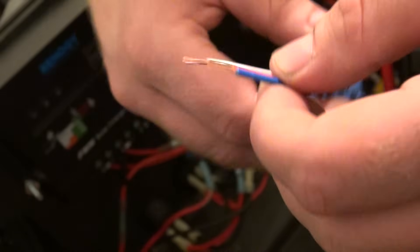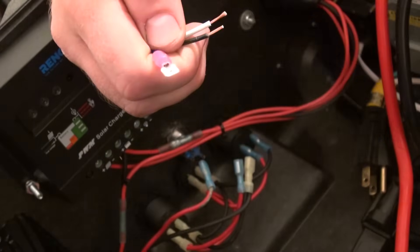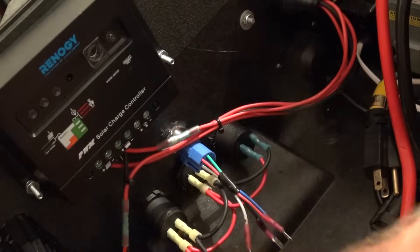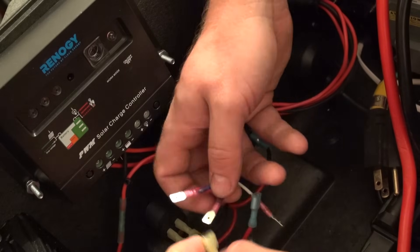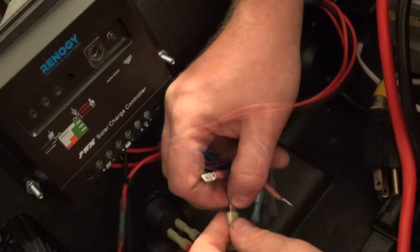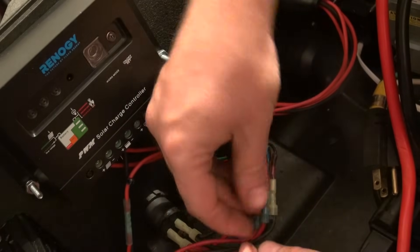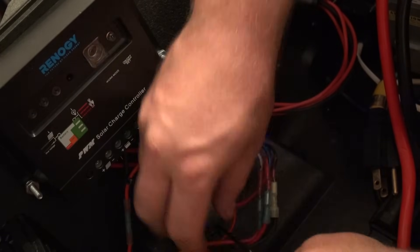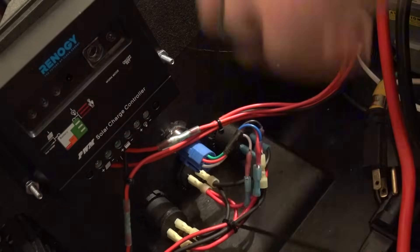The alternate way you can wire this, if you've already installed the old switches, is to wire the male spade crimps directly to the new harness for the new switch. These will act as a direct swap-in for the old pins on the original switch that we used. You will wire up the connections the same either way, no matter which route you decide to use. Just like with the other switch, once we have all the connections in place, make sure to add an additional zip tie to bundle them neatly out of the way. Repeat this process for all three switches.